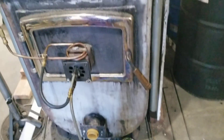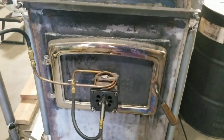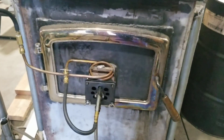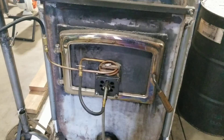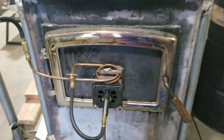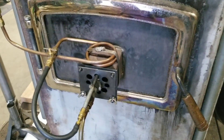The stove is built from a 150 gallon tank. I welded in a square frame out of angle iron and I have this wood stove door — a Kodiak 1700 — which I got for free because the nickel is peeling on one corner. I removed the ceramic glass and put in a steel plate so I could mount my oil burner nozzle.